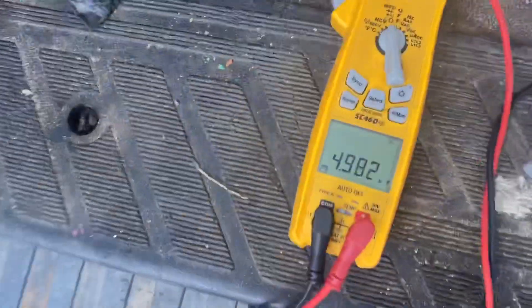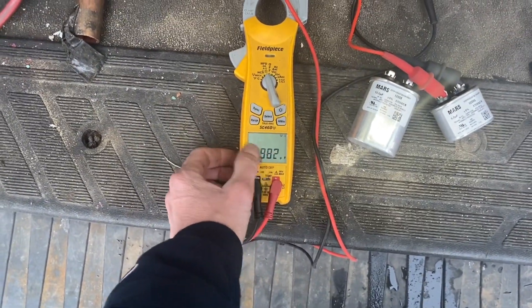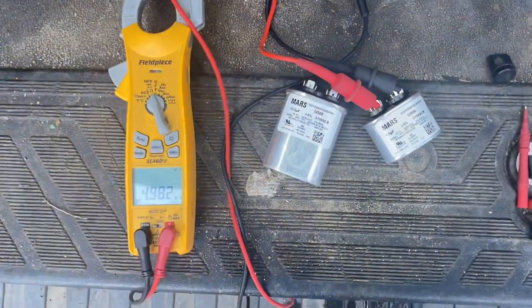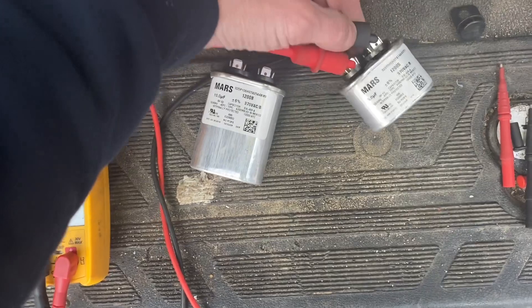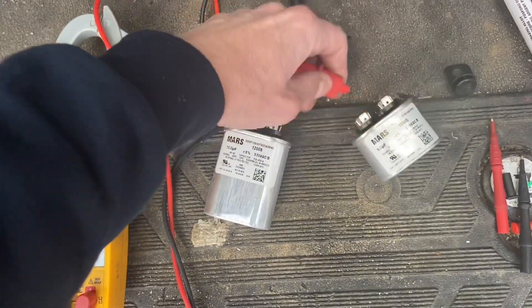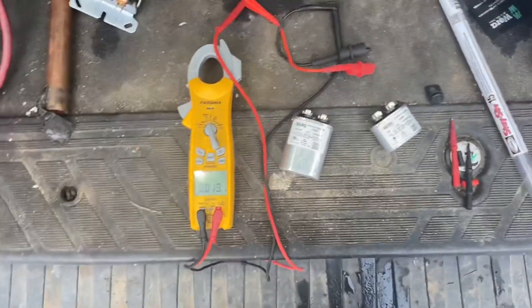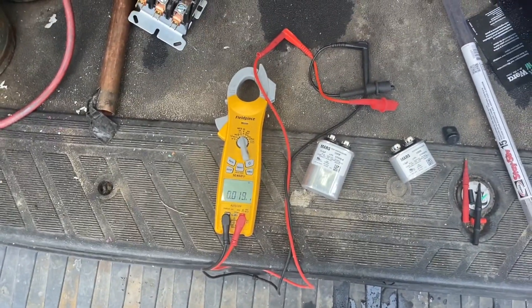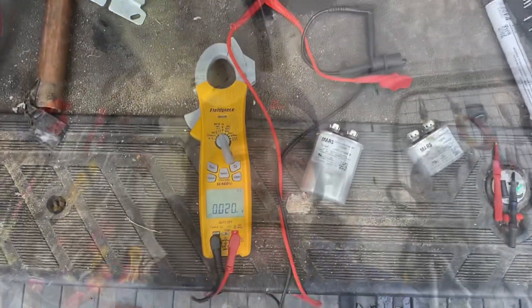Reading 4.9 — that is also good. If they're too far up or down, they're bad. If this was down at like 4, I wouldn't want to use it. You want it to be pretty close — say 4.7 to 5.3 or something like that. For a used capacitor, if it's bad it won't read anything, may read really low, or nothing at all. It's pretty obvious when you test them — you'll know right away.